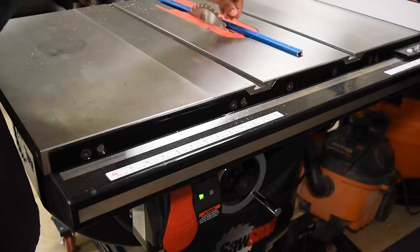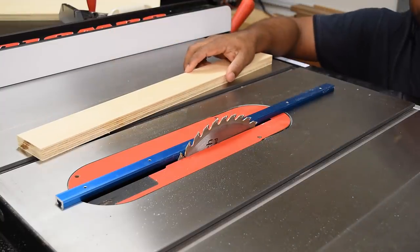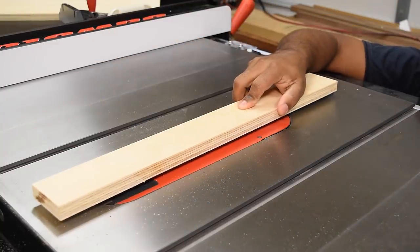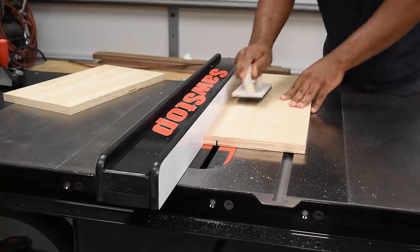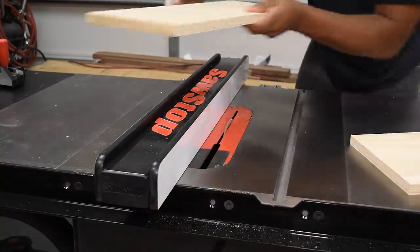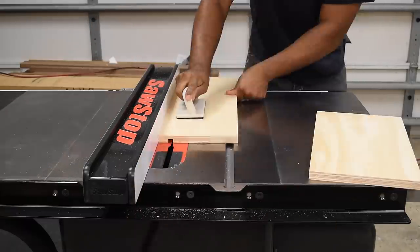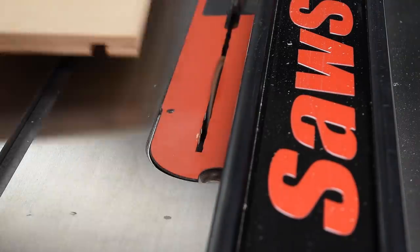As I was making these adjustments I noticed I was triggering the sensor in the table saw. This table saw is designed to be the safest you can get, and I could bypass this safety feature but I really don't like messing with it because I don't want to forget to turn it back on. This video is not sponsored — it's more like a heads up if you happen to own one of these. Now cutting out the slot for the T-track, you could route this out, but by the time you pull out a router, switch the blade, and adjust the depth, I can already be done ripping this on a table saw.